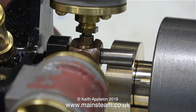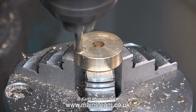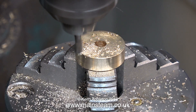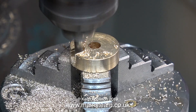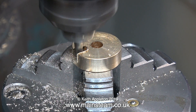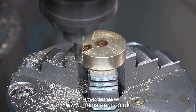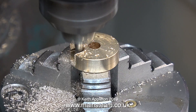This clip shows the phosphor bronze part fitted onto the shaft of the rear engine. What I need to do now is mill a slot in this part. I could drill a hole exactly the same distance from the crankshaft to the crank pin, but I showed in an earlier episode that my original plan for coupling the engines together really didn't work — alignment of the engines was fairly difficult. By machining a slot it will make up for any slight misalignment.